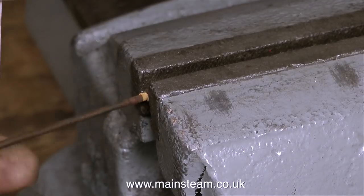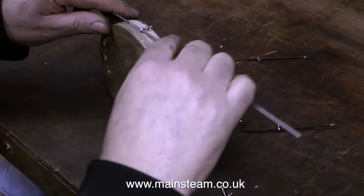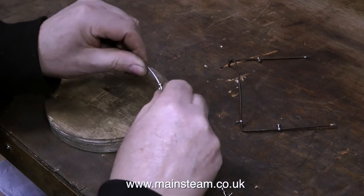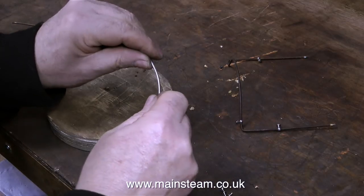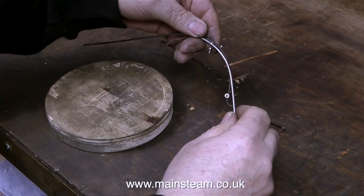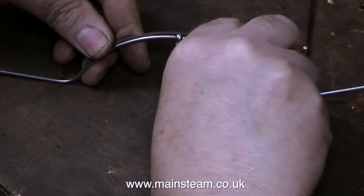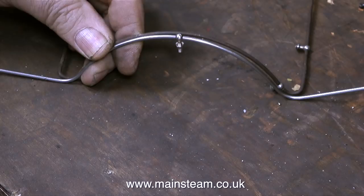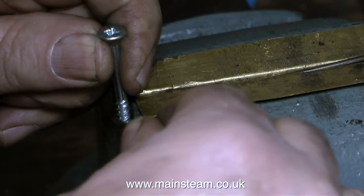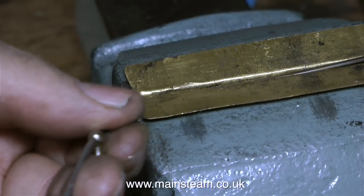I've said many times in these video tutorials that when you're silver soldering, always put the nut on the pipe first — and the same thing applies here, though this won't be silver soldered. You need to put the handrail stanchion in place to start with — only the center one; the two outer ones can be slid on when it's completed. I'm using a round piece of wood to help get the correct curvature, doing it by hand with trial and error. Here's a top tip: a very coarse wood screw acts as a very useful guide to help bend the tight radiuses on the outer part of the component — try it yourself and you'll find it a lot easier. The pieces of brass in the vice jaws are to stop them from marking the stainless steel.